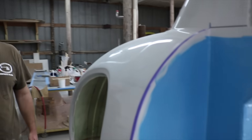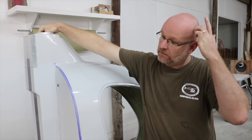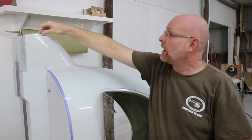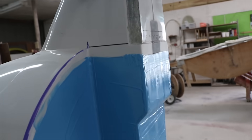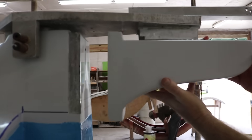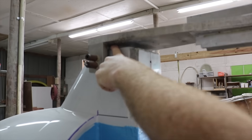These fixtures are level and square for the rest of the tooling that we're using. One of the first moves we'll do is poke a hole in the tower of the machine and put our first piece of metal in it — an eighth-wall four-inch tube that gets bonded on the inside of the fuselage. Another assembly that comes from upstairs is the upper gear mass reduction mount, and it is all tooled off of this initial piece of four-inch tubing.